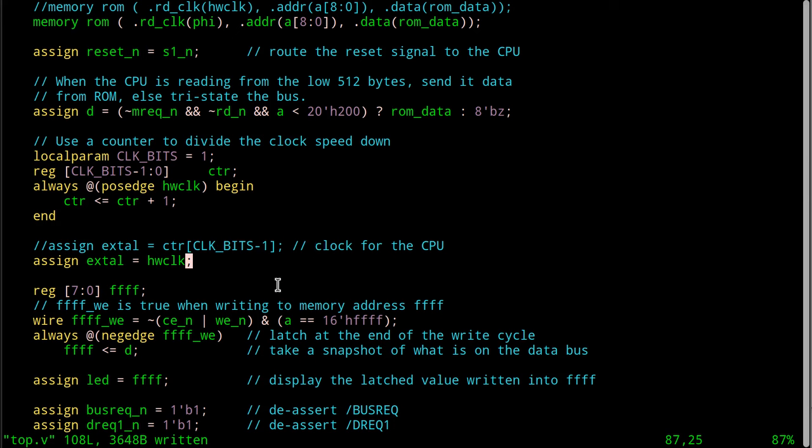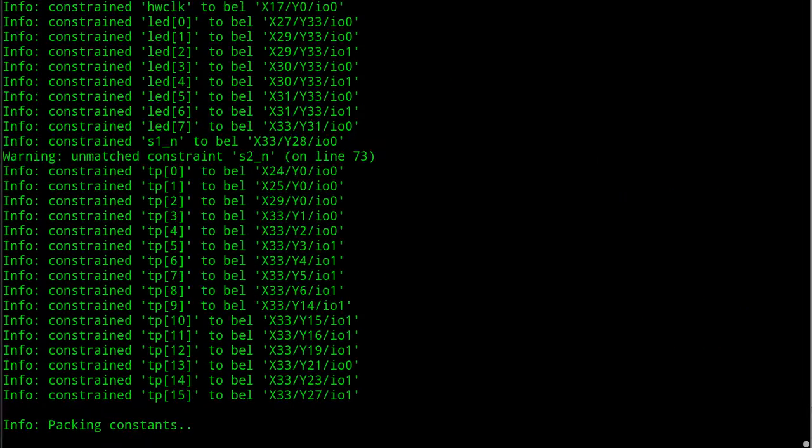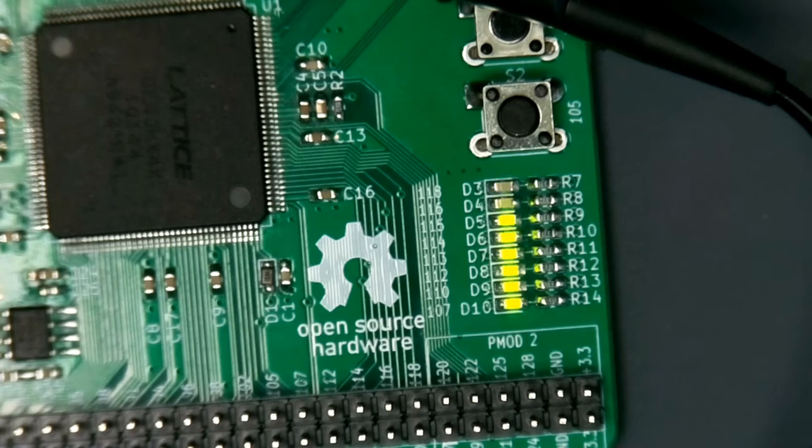I also know that I can tell the chip to run the PHY clock at the same speed as the crystal here. So it might be that to achieve 20 the right way would be to run this at 20 and then tell it not to cut it in half inside the SoC. But let's just see what happens. Let's just see if this doubles the speed and runs reliably. I suspect it will. Yeah, baby! That's looking pretty good.